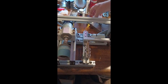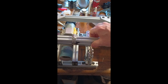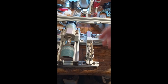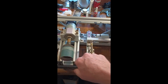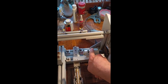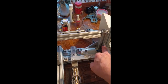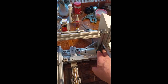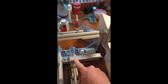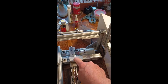On the reed-making machine, I'm taking the shuttle mechanism that normally I trace a reed out with, and I'm going to flip that back. Notice that aside from the main robotic milling motor here, there's another DC motor over here that I'd bought originally, but it turned out it couldn't run anything very square. So I put a circular saw on it and then put a linear slide mechanism here. That's how I'm going to cut these reeds.